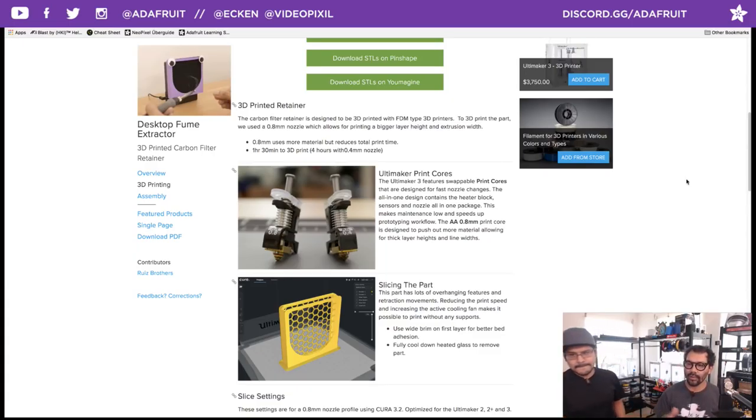Of course, it's sketch-driven design, so you are able to edit all of the sizes, as well as the thickness of the wall. If you have a shell that you want to increase, for whatever reason, if your slicer is messing with the tool paths, you can adjust how thick your shell is going to be until you get a perfect tool path. So cool, you do have the ability to do that.